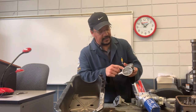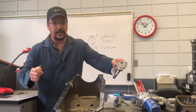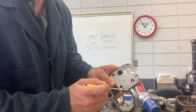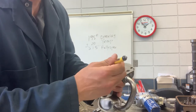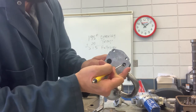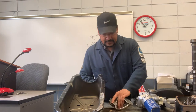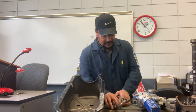Inside here where it goes to the pickup tube, it's got to go directly to the PRV valve — the pressure relief valve. I'm going to come over here to kind of show you when we test these things on a bench. It's spring loaded on one side over here as you can see. You would get your little pocket screwdriver and come over here and push it out, and then you should see it retract and hear it click. That means it's a good working pressure relief valve. We're going to get to the diagnostics of that in the next lecture — what happens when it's fully open and what happens when it's fully closed and stuck closed.